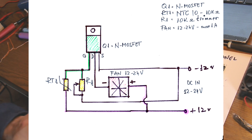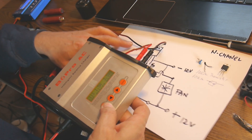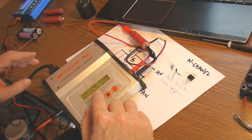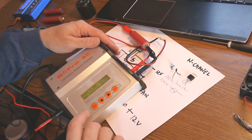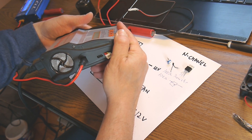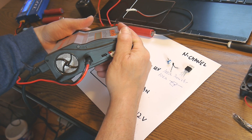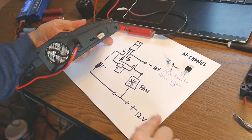I don't want to open it up because it's already installed, but I can show you how it's working. I'm currently doing a discharge — discharging a lithium-ion cell at 1.5 amps — and it generates a lot of heat. If I cover the inlet you can hear the fan going faster and faster, because the thermistor senses the rising temperature and passes more current to the fan.